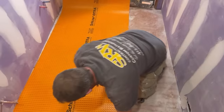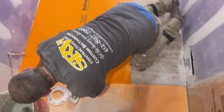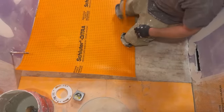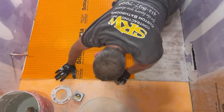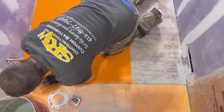So this is going to give us our extra 1/8 inch to meet up with this pan nicely. And that was after adding some 1/4 inch strips to those joists, because the 38 by 60 inch pan is 1 1/8 inch thick. So you have to overcome that thickness to have this meet up nicely. I'll just cut this nicely here.